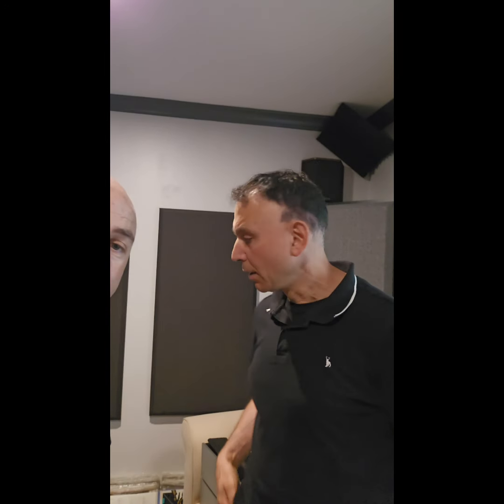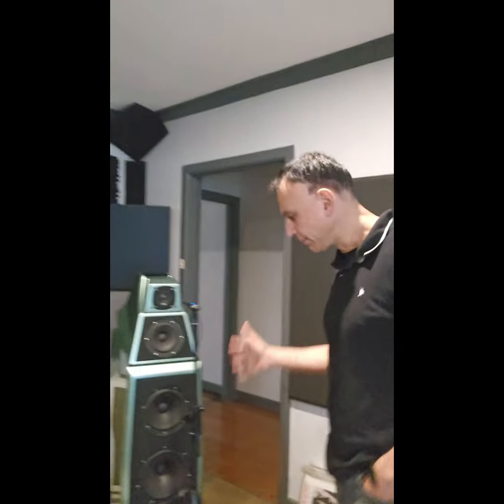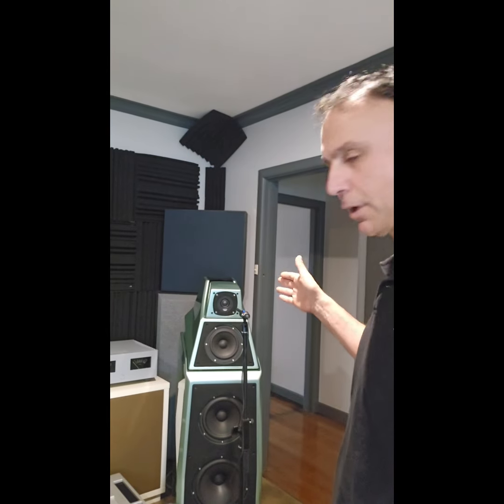I'm going to hand you over to John to explain what we've done in the room here, just before going off camera, so you can understand exactly what we've measured and what John's found. So — we've got a tripod setup, aiming the microphone, which is a high-res 24-bit 192k, on-axis with the tweeter, so we can measure predominantly what the tweeter response is. We're measuring SPL on the left and right channels so we can compare the differences.